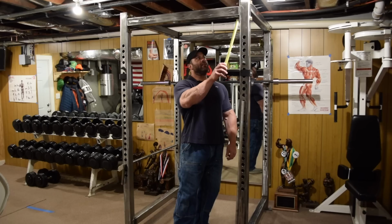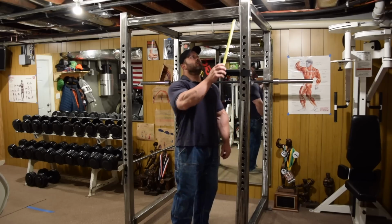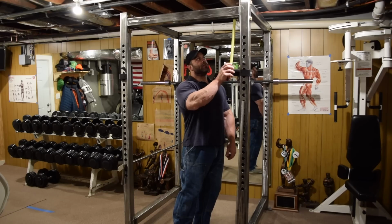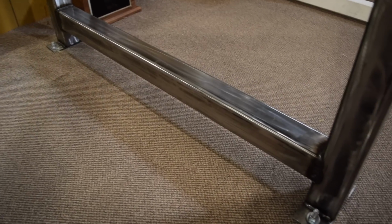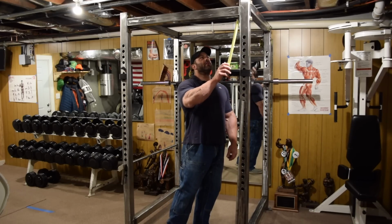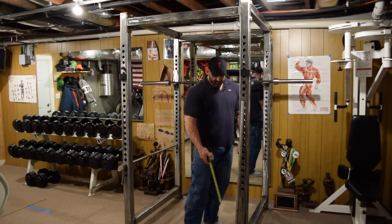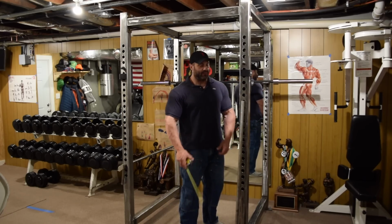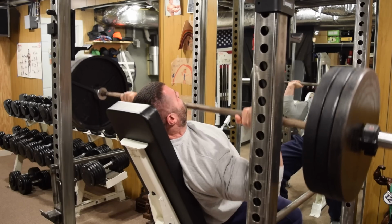These plates that you see here are, again, 3 inches wide, and I went 7 inches long, which would allow me 2 inches of overlap so that I could put the bolt, whether it's this bolt here or the bolts that I use to anchor. Up here, these are 3/4 inch diameter, and these here are 1/2 inch diameter. The thickness of this plate is 1/4 inch. I don't think it's really necessary to go with anything thicker. 1/4 inch was heavy enough. For the floor ones, you could maybe go a little thicker, but honestly, man, I put all my strength into this thing, and it barely budges.